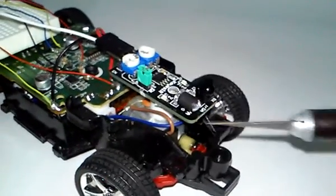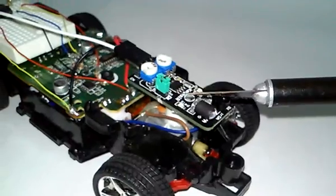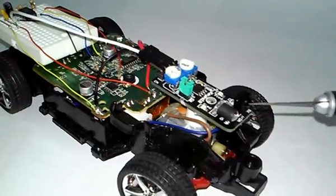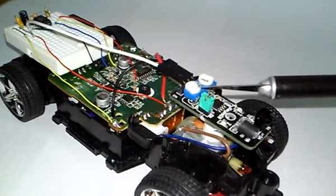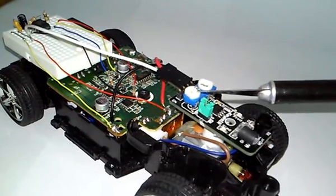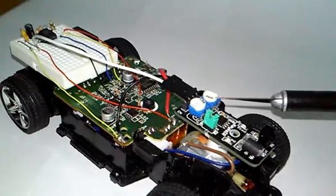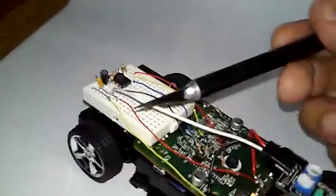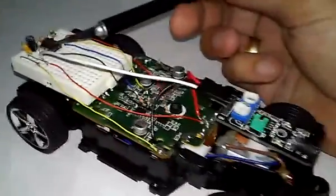The front sensor — a $2 sensor — has a 555 timer on board that sends pulses to an LED and looks for a reflection through the receiver. As I recall, I think this first pot here I just cranked fully clockwise, and this one increases sensitivity counterclockwise — I cranked that pretty much all the way counterclockwise. The output from that gets fed into input-only pin C3.